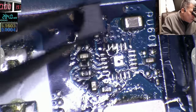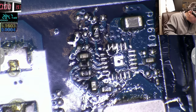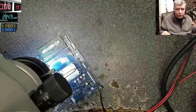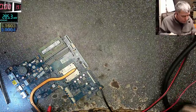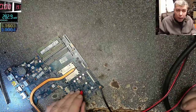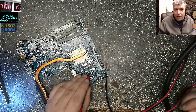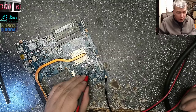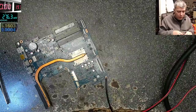The chip position. Oh, it's marked on the board anyway. Okay. So now if we are checking with the power supply on the same point, that's me here, it's taking no power, you can see, no power, that's the issue. On this side here is ground, although the capacitor on the other side is plus 19 and it's fine.